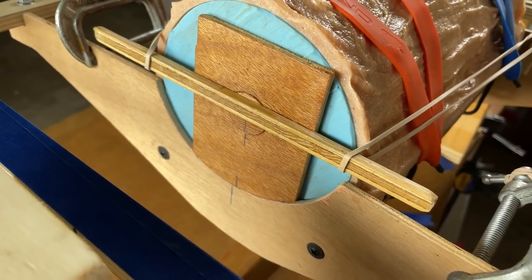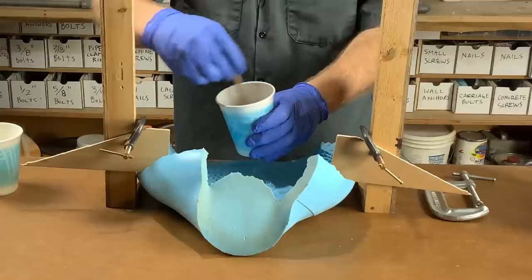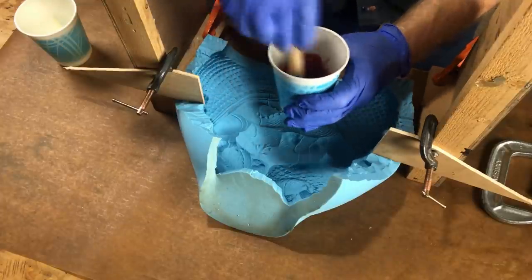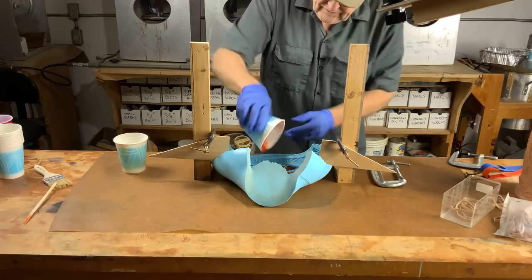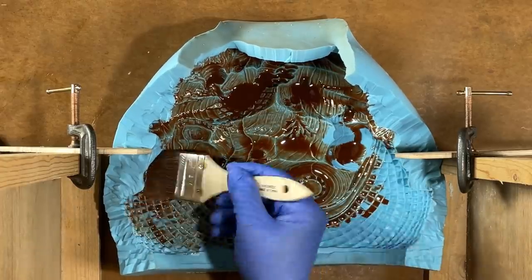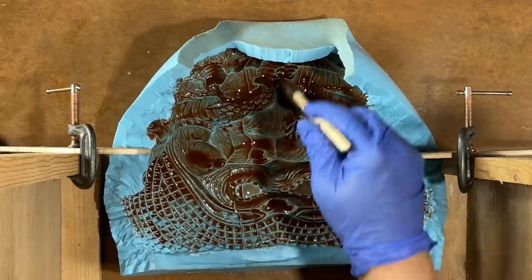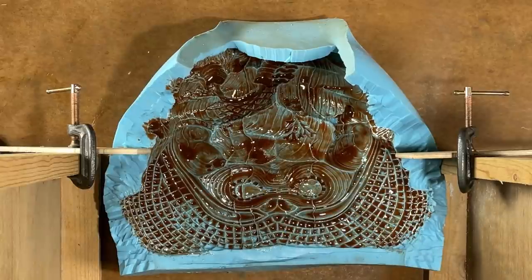You really want random rotation, but it's a good idea to have a clear idea of what your shape is inside, because that way you're thinking about where the resin is flowing and what's filling. This top is very simple — it's just held on with two rubber bands with very simple wooden cleats. We're going to begin making this casting by pre-painting the mold. If I rotate this mold with all of this detail in here without pre-painting, we're going to have bubbles. Take a brush and just brush the resin into all of the cracks, completely coating the surface as much as possible. The brush can go into acetone to save it.